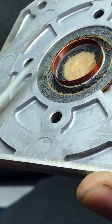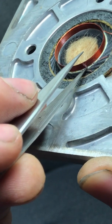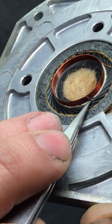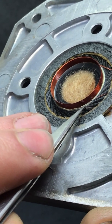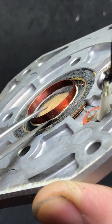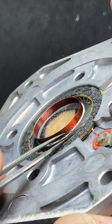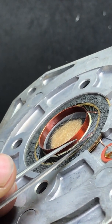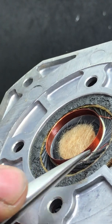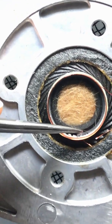What I had to do — and I already did this before the video — is pry open this part very, very gently, and try to pull a small section of the coil out, like you can see here. Eventually what you can do is resolder the terminals together. I suggest putting in some epoxy here as well, because there is a very good chance you will damage this part, so you have to apply a little adhesive here too.